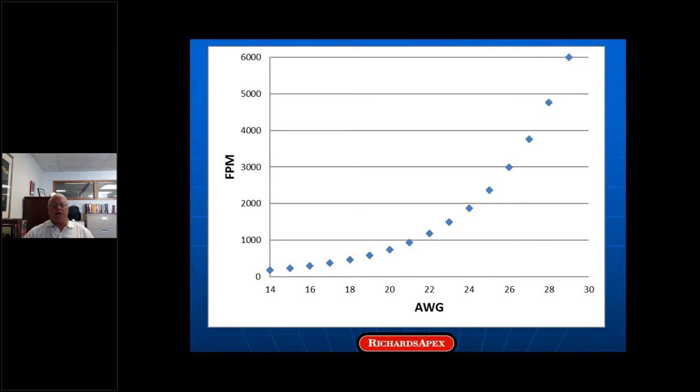This is a chart of speeds in a hypothetical 16-die intermediate wire setup with a final speed of 6,000 feet per minute, assuming a 20.7% one AWG difference at each die, reducing the cross-sectional area by 20.7%. The speed increases exponentially, and friction follows the speed. Notice that wire speed increases by about a thousand feet per minute at each of the last few dies. Between the increased speed, increased friction, more hardening of the material, and more lineal feet, the dies at one end of this process operate under very different conditions than the other end — and it's no wonder the downstream dies wear faster.